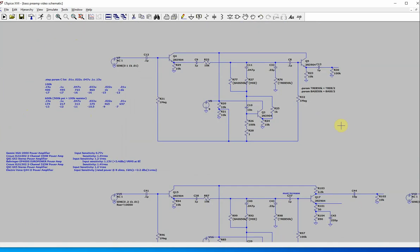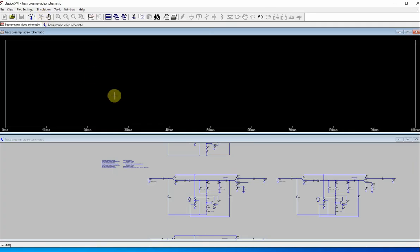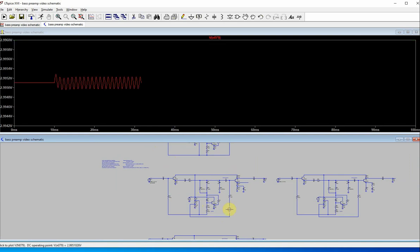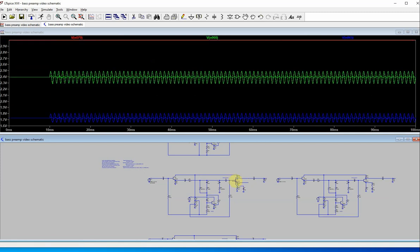So I changed from the Bode plot to just ordinary wave. And let's see there. It's stepping through stuff. We've got, this is obviously getting 9 volts. Okay, you got 6 volts, and you got 3 volts. So this should be 3 volts here. Now this is forming a voltage divider between here and here, 100K and 300K. So this is going to further step down to 2.38. And then right here, you've got it down to 1.7. So that leaves a lot of room for this.